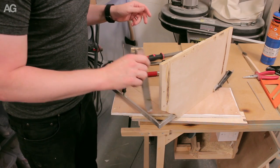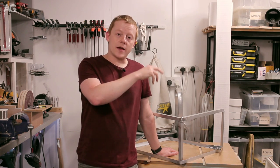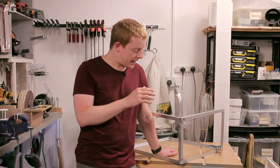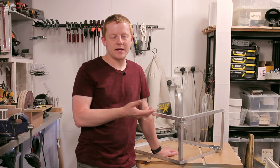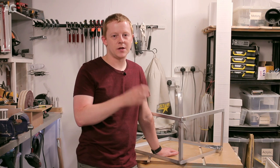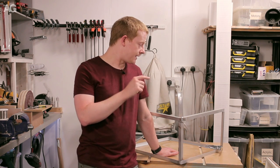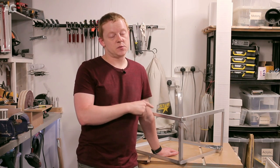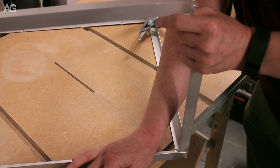I think this is a good method for its initial purpose, the intended use, where it was just framing a piece of wood. So that wood provided all the core strength. And the brazed joints, they helped a little bit, but they also made the corners slightly more attractive because you could file it down quite neatly. I think for this purpose, it just doesn't work. It's not suitable for any kind of structural or strong join like this.